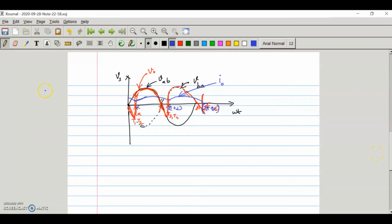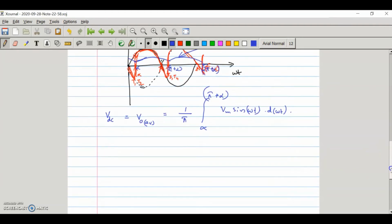And with these waveforms, from this output voltage waveform, we can obtain the average value of output voltage, VDC or V naught average. Average value of output voltage, we can write it as, it is repeating in nature, periodic, so 1 by pi integral alpha to pi plus alpha. It is existing there, so it is Vm sin omega t d of omega t. So this will be equal to 1 by pi into Vm into integral sin omega t, it will be minus cos omega t. So within limits alpha to pi plus alpha, it will be Vm by pi,